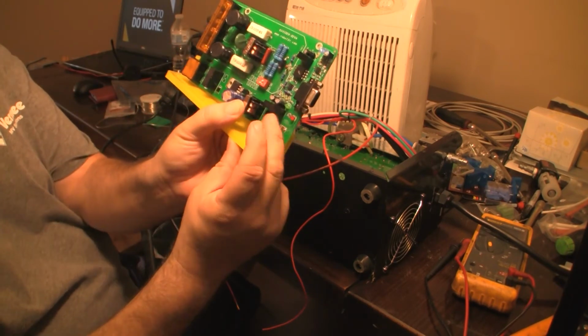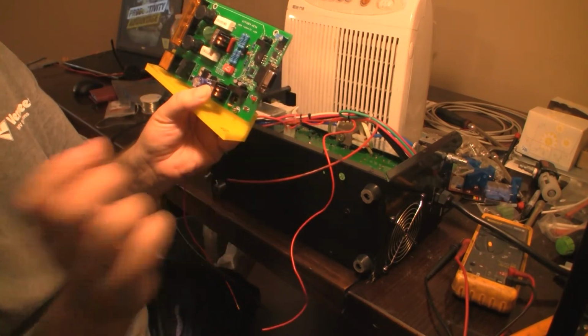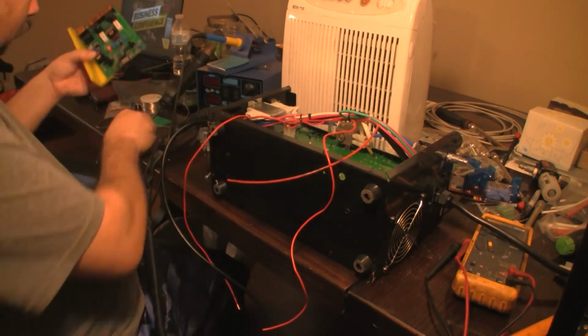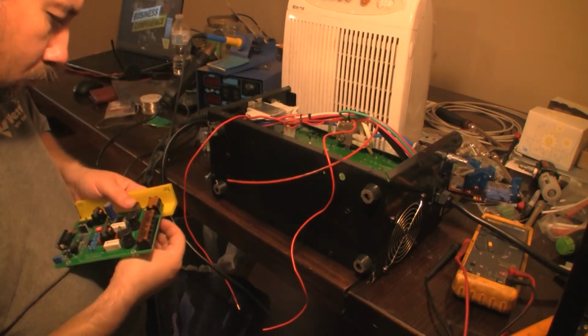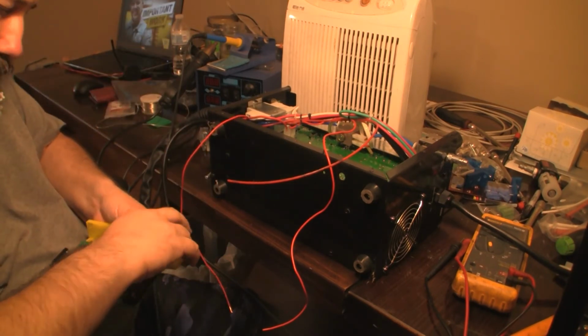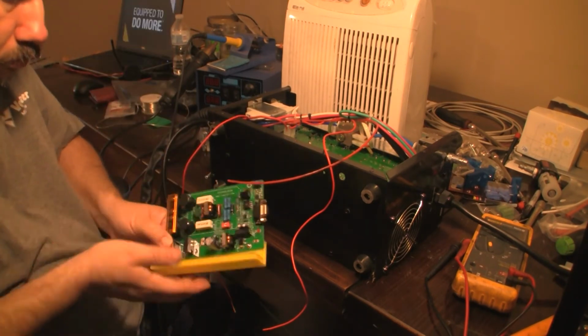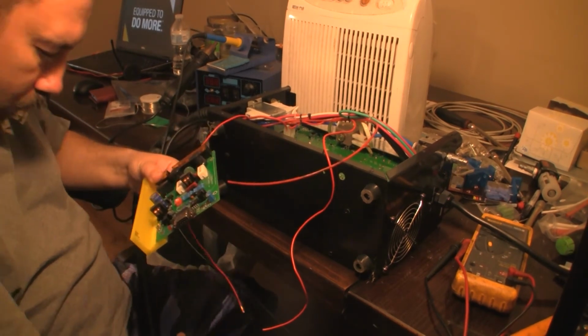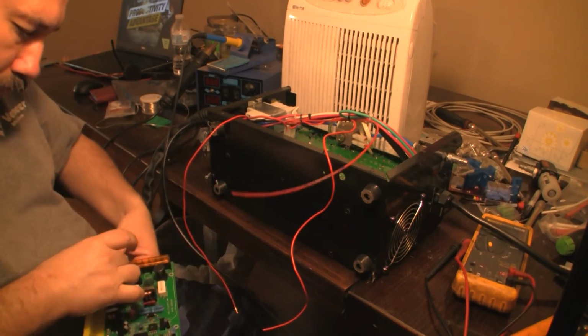I will be hooking up wiring from both the positive and negative torch/ground hookups. I need this voltage divider as I want to use an Arduino circuit later on and code to read 0 to 5 volts and run my torch height control with it. The Arduino can't handle the 50 to 300 volts that might come from the torch as it's cutting.